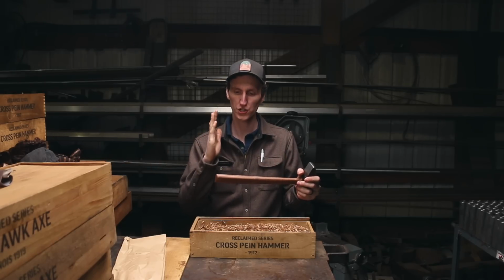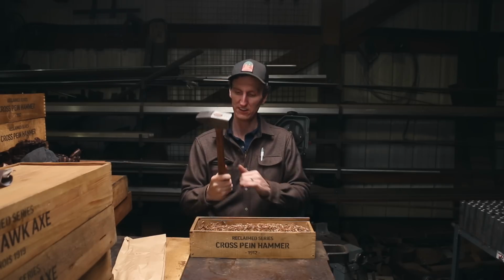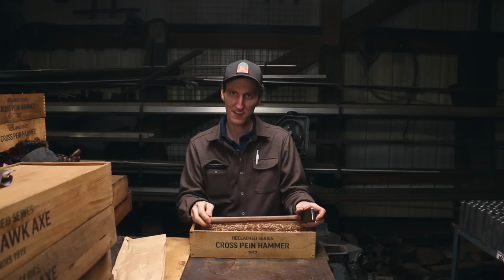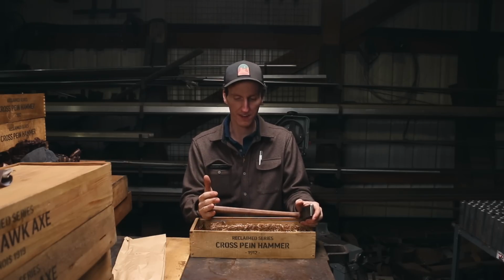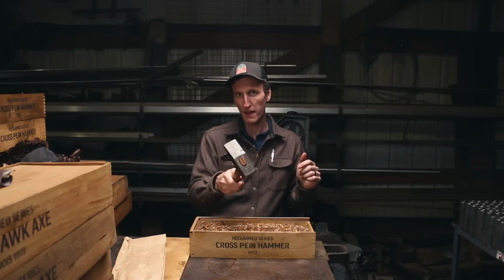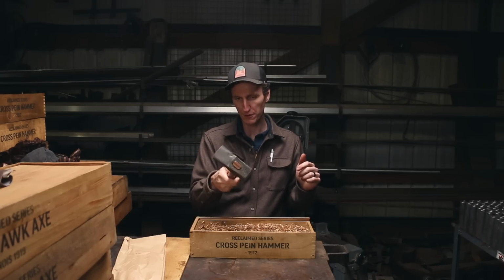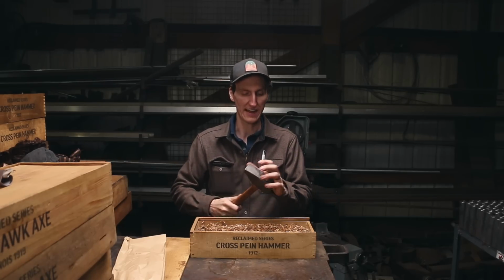You can for sure trim it down to 14 inches. I just felt like it was nice to have a little bit of that extra go on there if you need it. It's got the nice rectangle handle. I'm a big fan of that, especially a big fan of flat sides on my handles. And that just allows you to feel that tip like that when you're forging, which you're always adjusting for your angles. It's really important, actually.